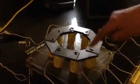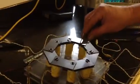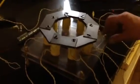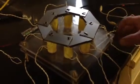I'm going to make better coils, because these are 12 volt solenoid coils — that's where we got the soft iron from for the rotor segments, and those plungers you can see sticking up are also soft iron. But I think what we're really looking for is more of a flat pancake coil with a heavier winding so we can push a bit more current. Anyway, that's where we're at so far — thank you very much for watching.